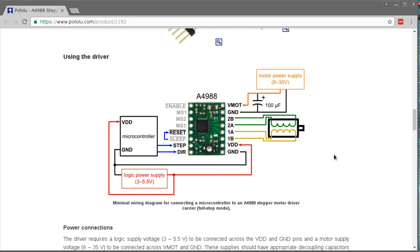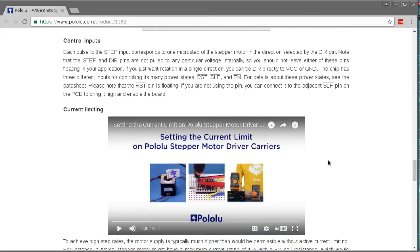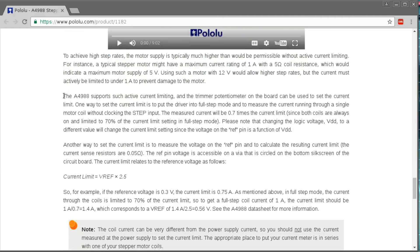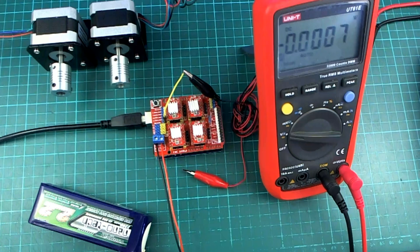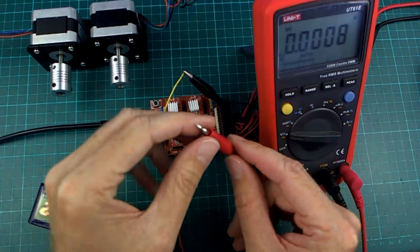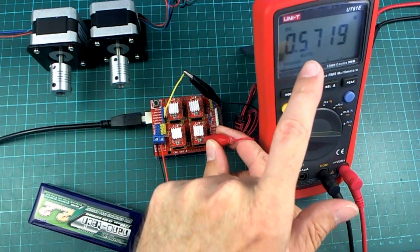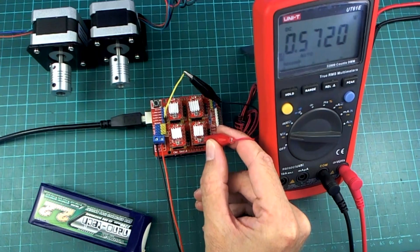For this particular one it's slightly different, but fortunately I found it's almost the same. The way you do it is by checking the voltage on something called the current limiting pin. My board doesn't have that pin exposed as a pin on the board, but fortunately it is exposed as the top of this potentiometer. That's why I've got my voltmeter clipped onto a tiny little screwdriver, so as I touch this and turn it I can see the voltage on the top of that potentiometer.